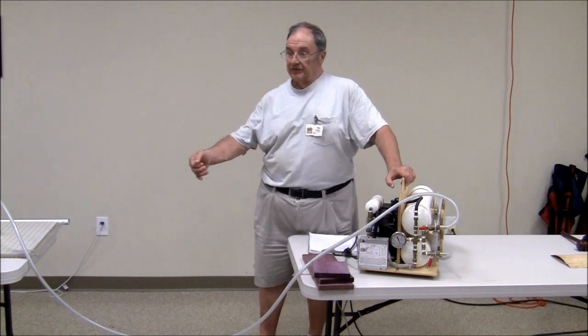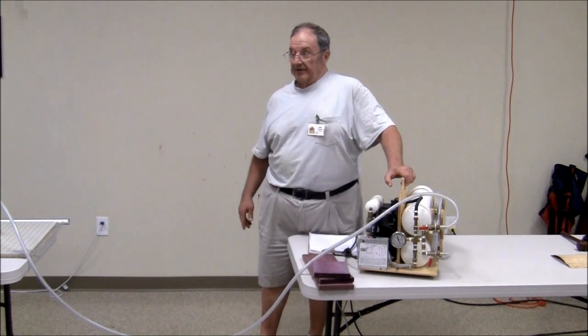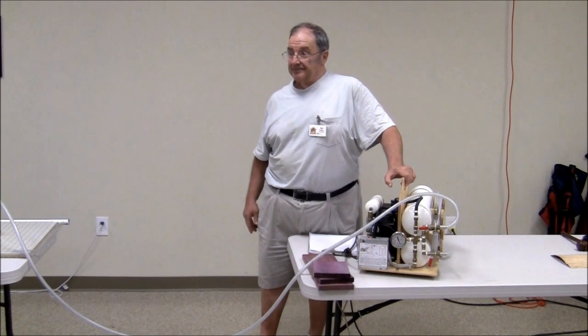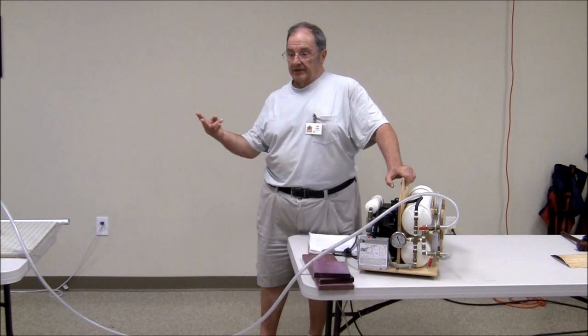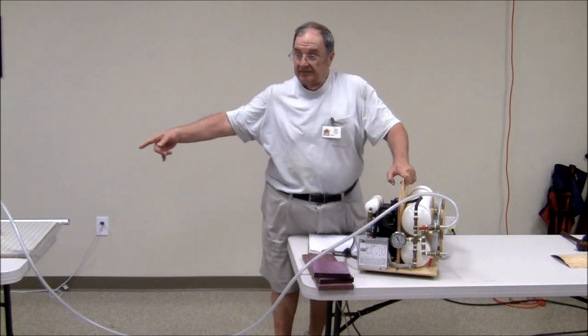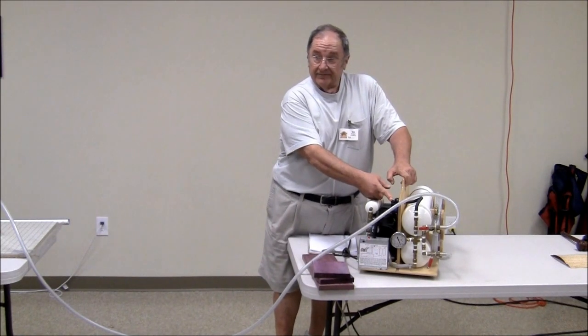It's about like using one of those air nozzles, so that when the bag needs air, that MAC valve is the same thing as pressing one of those levers on an air chuck. But how's the MAC valve sensing the pressure in the vacuum in the bag? Well, the key thing you might be missing there is the vacuum switch, that is sensing the air or the absence thereof. Well, I didn't see all that when you showed the venturi up there. I didn't see all those other things in the drawing.